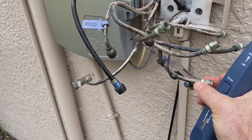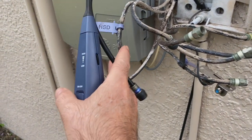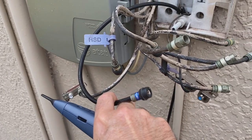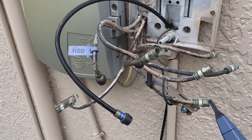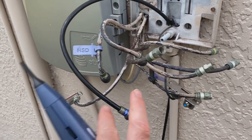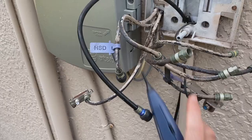That's my master guest room that I want. So I'm going to put a piece of tape on that so I know which one I'm dealing with, and then I can reconnect that to the cable that came from the street. I've got a couple more to do so I'll put a splitter in. But do you see what I'm doing? I'm isolating - finding one cable at a time with the toner, labeling it, then I can go back and connect the cable from the street to the cables where I need service.